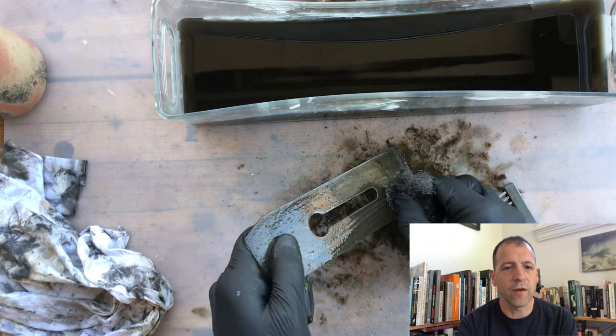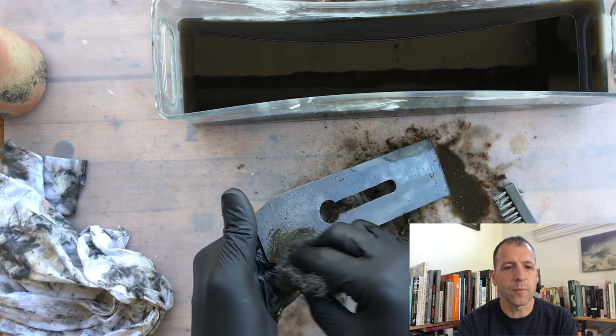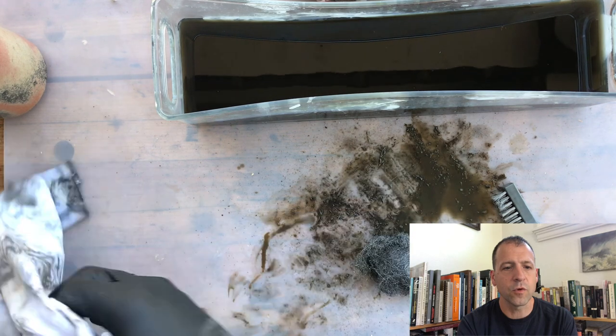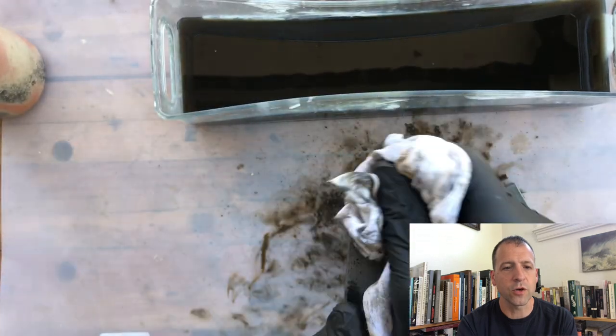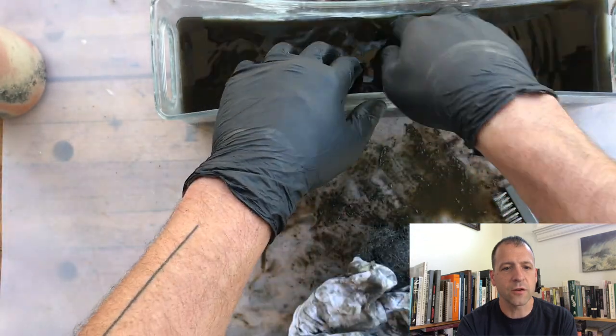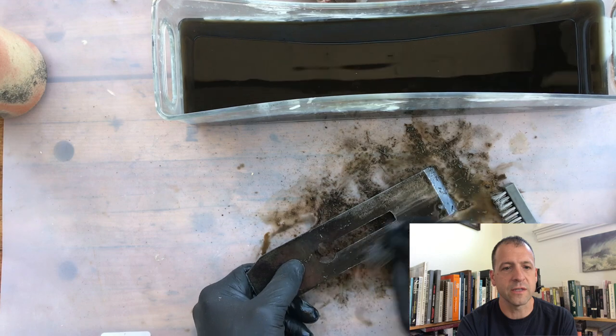And at first it was really expensive, so what you'd see is tool manufacturers would take a blank of wrought iron and then forge weld a piece of cast steel to the end, the part of the iron where you sharpened it. You can see, on the one that I have right here, there's discoloration down towards the tip. That's the cast steel part, and the rest of it is a different kind of metal.